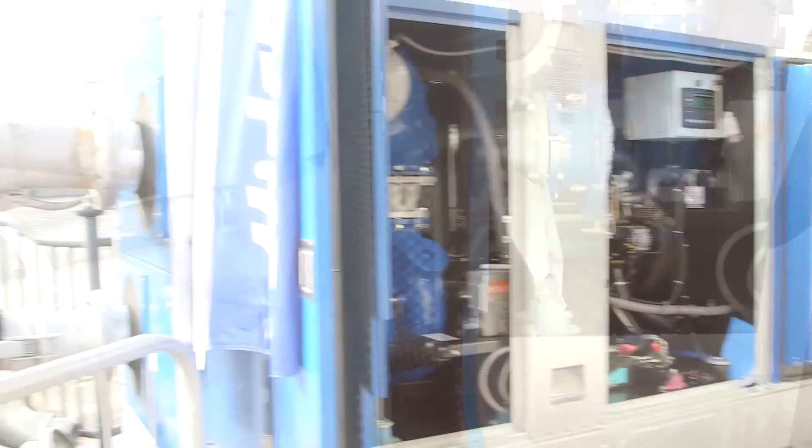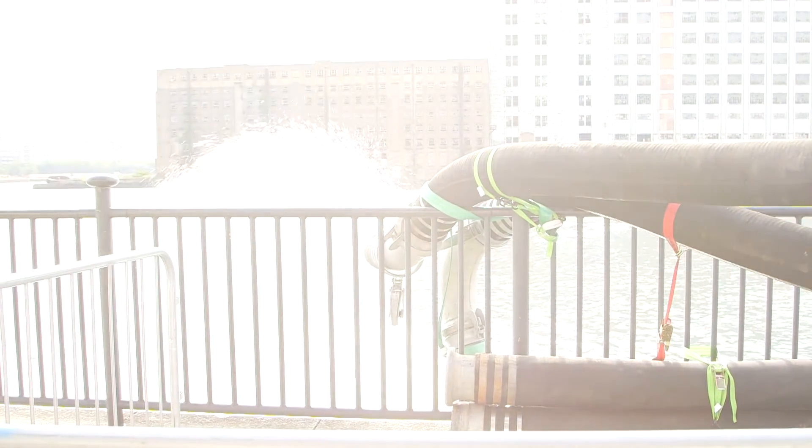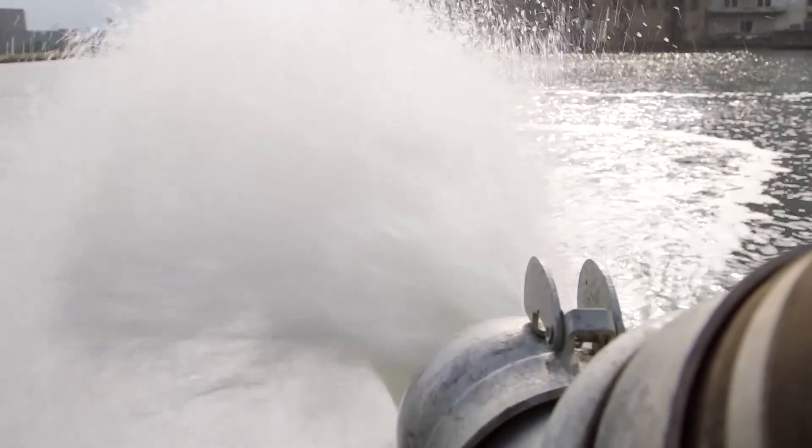Two of the main features of the Super Betsy are the noise — they are extremely quiet, with double insulation on the enclosures, achieving typical noise levels of 64 dBA at 7 metres. They're also extremely fuel efficient, and a full tank of fuel will run the Super Betsy for approximately 64 hours at best efficiency point.